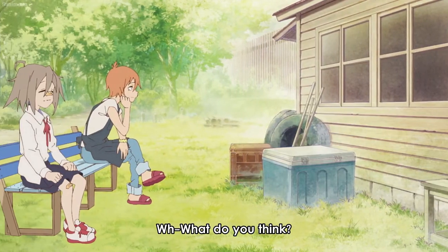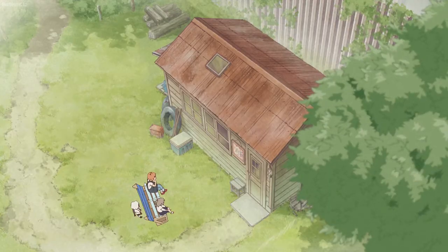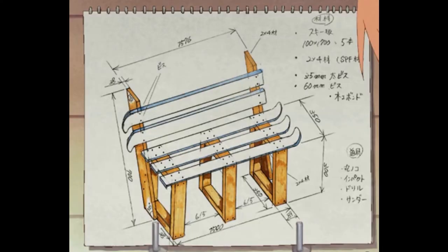The other problem I have with this design is waterproofing. This is an outdoor bench, but no mention is made of the serious problems incurred by leaving untreated wood out in the weather. If you want to set something made from wood directly on the ground — particularly outside — it needs to be made from either a rot-resistant wood like teak or ironwood, or pressure-treated lumber, which is lumber soaked in a high-pressure bath of toxic chemicals to poison attacking fungi, bacteria, or bugs. It also needs to be coated with an exterior-rated stain, or an exterior primer and paint.